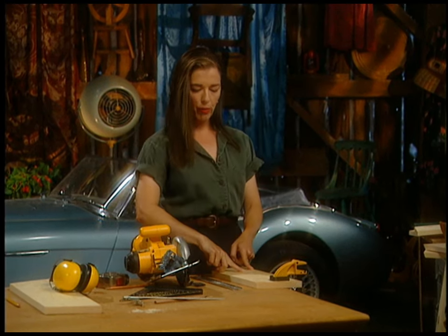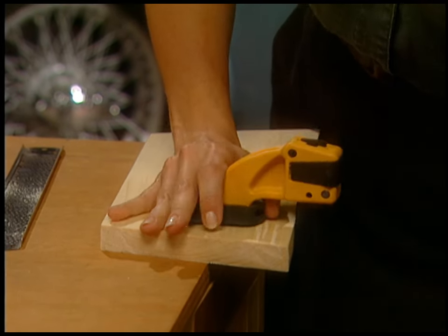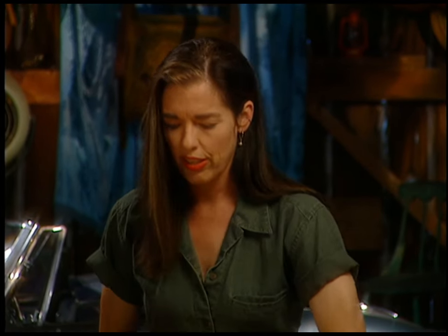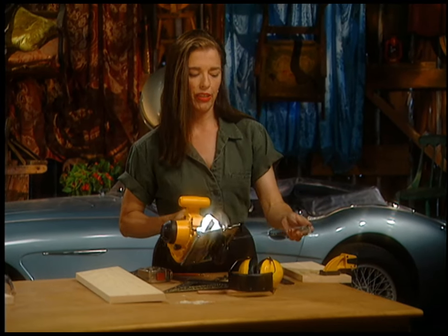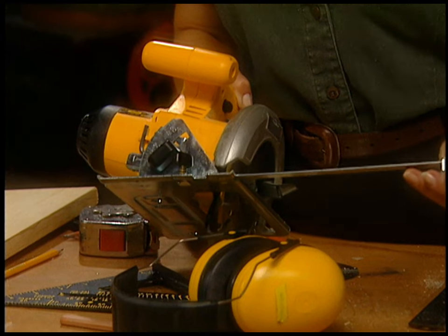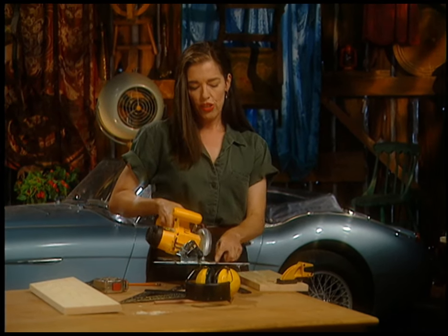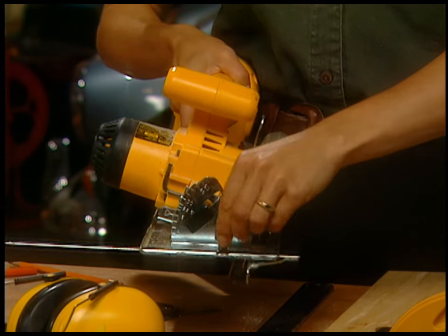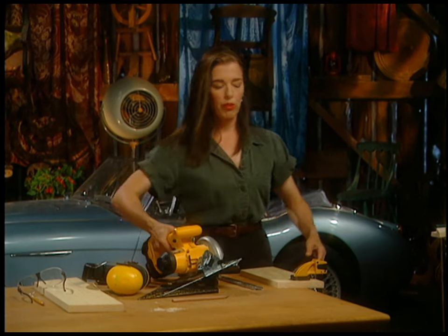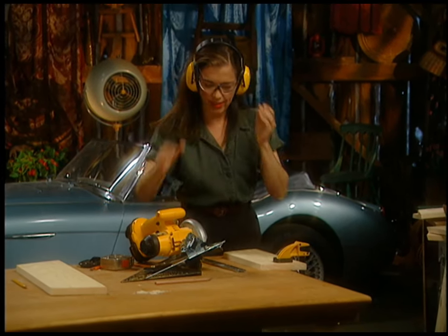This is going to be the part I want to take off, so I've actually got this upside down - you have to keep thinking. Once you get used to your circular saw, you're going to want to just sleep with it under your pillow, I promise you, because it's such a great tool. The only other thing you want to add is this little doohickey that comes with it, which you think you're not going to use, but you are - because it's a fence and it helps you keep the saw going in a straight direction so you don't have any freehanding problems. It's got this nice little gauge, and you want to adjust it so that the zero and the cutting guide line up right on that, because I don't want to take anything off the top corner of the board - I just want to take the bit off the bottom.